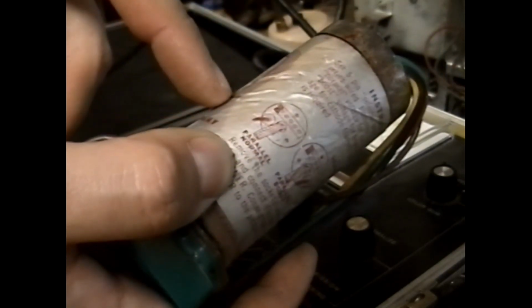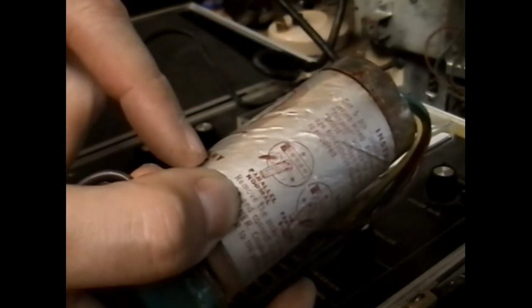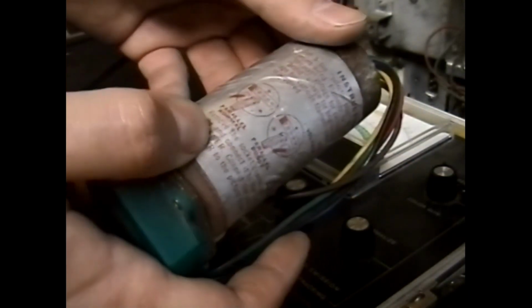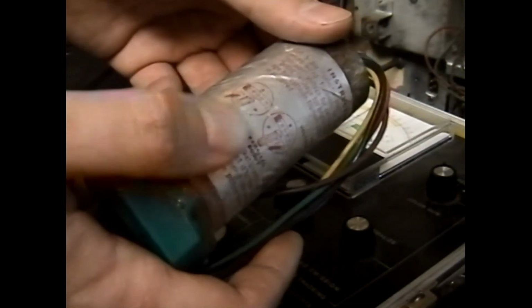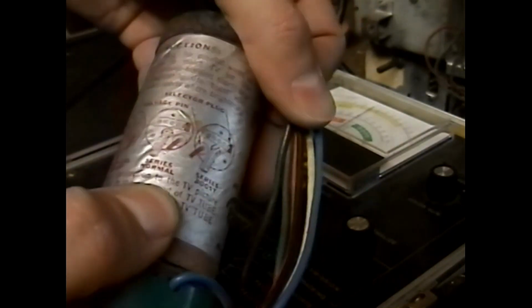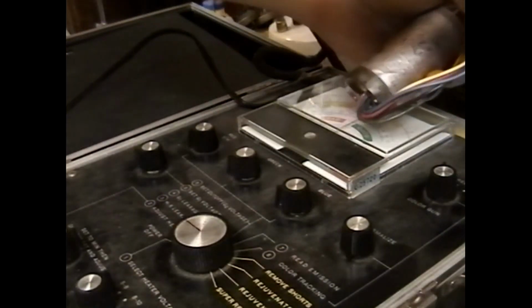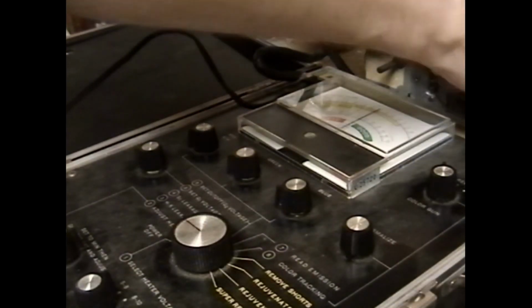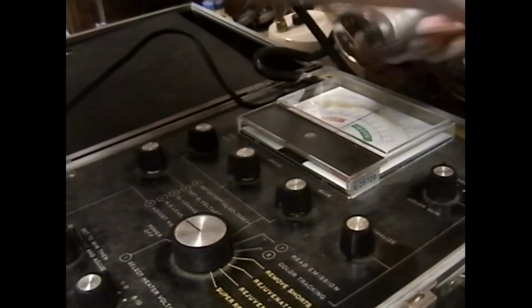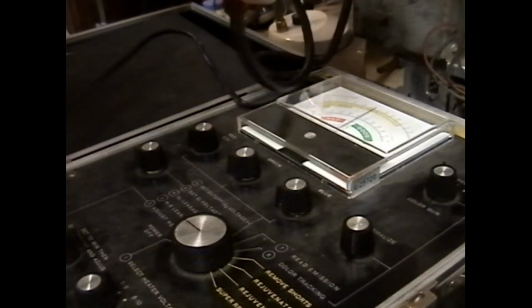It just isolates the heater winding from the rest of the circuitry in the set to alleviate problems caused by heater cathode shorts. So it's already configured in this mode, which is what we want, so we'll use that to eliminate the short. You also have a series normal and a series boost for series heater hot chassis TVs. Since we're using this brightener with a tester, the tester's definitely parallel wired heaters. I like it when a socket gives me a satisfying crunch like I'm breaking it.